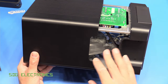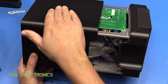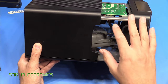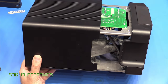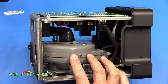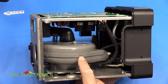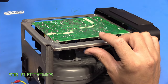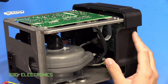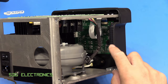So we've got an interesting construction and that starts to imply that the assembly costs are a little bit higher for a device like this. This whole section is actually made of metal — it's just the front part that's plastic — and then we've got this inner chassis that's holding all of the insides together so there's no screws or anything like that on the outside. So here it is outside of the chassis, and the first thing you notice is the size of the blower. This is absolutely huge — it's a brushless DC motor at the bottom and then really quite a big fan. I think this is the biggest that we've seen in any of the Quick stations. Then we've got a PCB at the top — this is the power supply as well as the brushless DC motor controller, and then we've got the user interface PCB at the front there with the microcontroller.